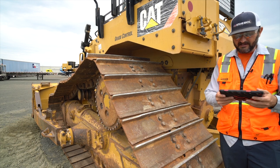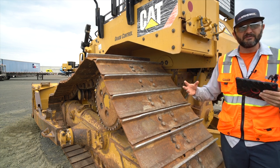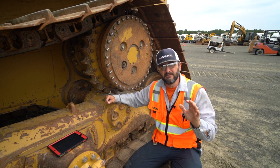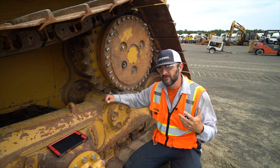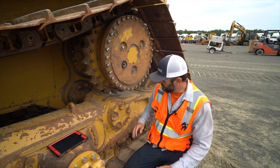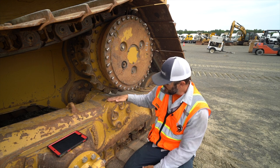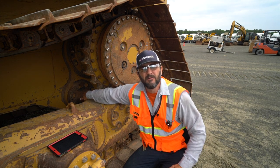The next checkbox is System One undercarriage — I'll go into that in more detail later. Next up is pivot shafts. Not all dozers have pivot shafts; there is such a thing as a rigid frame track frame, and you'll find those on smaller dozers — D39, Komatsu 650, John Deere, D4s, stuff like that. The pivot shaft is right here — it's this big shaft that the actual track frame pivots on. The end cap is right here; it comes off giving you access to the pivot shaft. Look for any movement and oil leaking from here or from the seal back here.